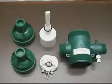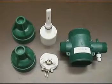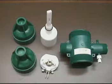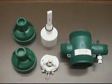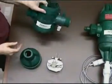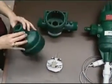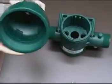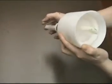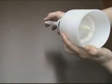The water motor section consists of the external green casing and caps and the internal intake exhaust valve module and the motor piston module. Note the rugged construction of the casing. The water flowing into the inlet is alternately directed by the intake exhaust valve module from the top to the bottom side of the motor driving piston, creating an up and down action.